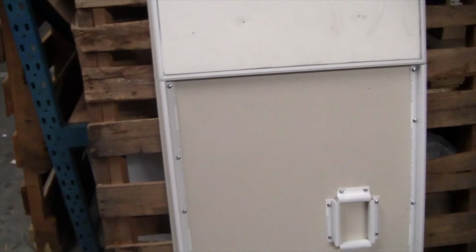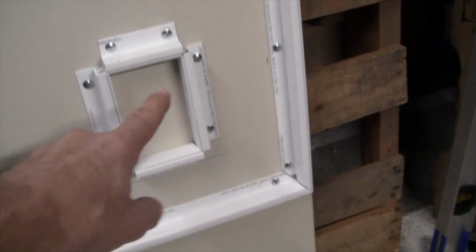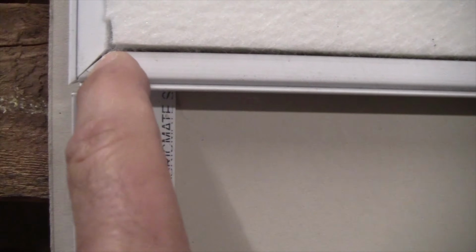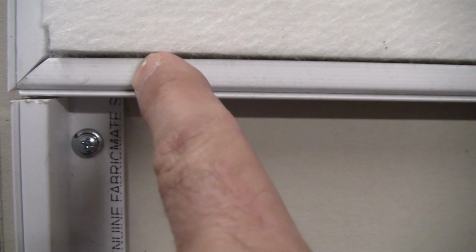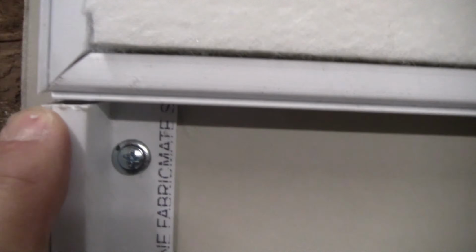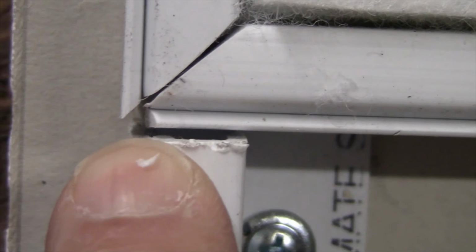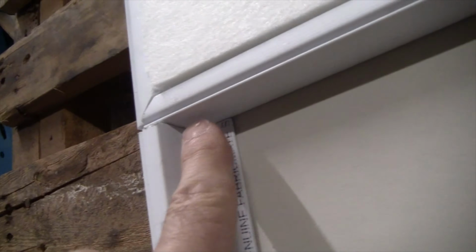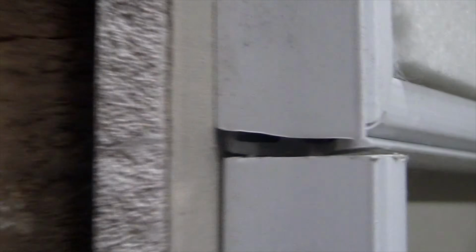I had a little bit of free time and I did not have my camera with me, so I put in this piece here, the bottom piece, this section right here, and this piece coming up right there. You already saw the top section. The important thing is how I did the joint. So you'll notice that when I came down here to here, it's a 45-degree cut. You already know that on this piece right here, that's where I trimmed that one section right there, and also put the relief cut inside of here. See if you can see it. It's completely buried from here, and you can kind of see it if I go in from here. Inside there is that relief cut. That's basically how that is.